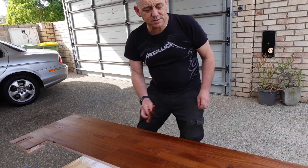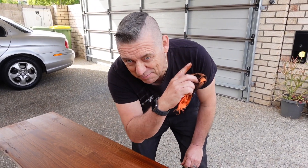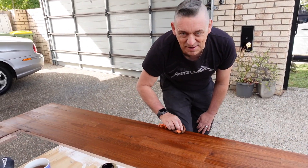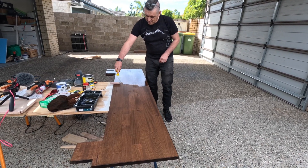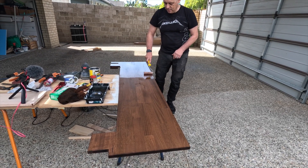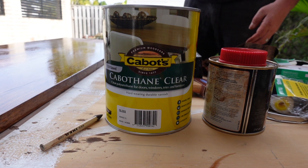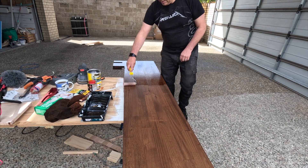Happy? Yes — the wood we're actually using is Tasmanian oak as a tribute to our Tasmanian trip. So after we put our stain on our bench tops we're now varnishing it and I think we're going to put two coats of this varnish on. It comes up so nice but I think it needs two coats just to set it off nicely.